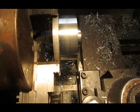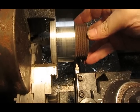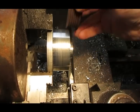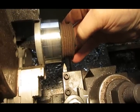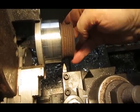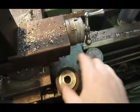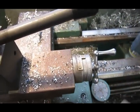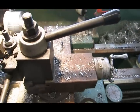Now I have a tool bit that is the right V-shape to cut the grooves for this pulley. We're making the pulley in this direction, so I'm going to figure out the distance from this surface to that first inside groove, then start figuring out how to make this. This is where my little increment scale will come in very handy, because I'll be able to dial it to the next increment and make a cut, then the next increment and make a cut.